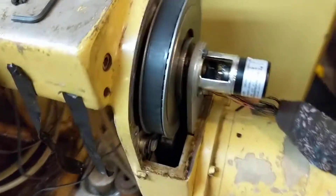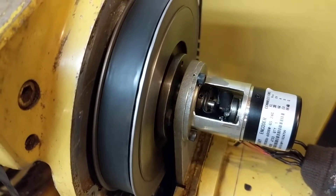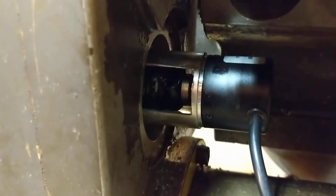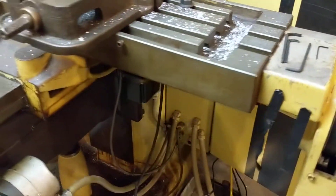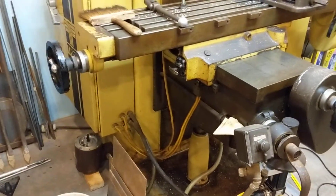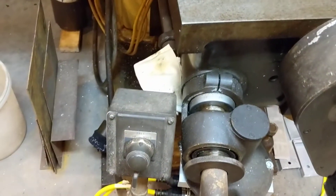The other good news: my encoders are in and they're working. They are full of glue at the moment because the coupler — that little figure-eight thing in there — those were absolutely broken in half. That's why I had so much error when I was doing some machining of parts last month. I couldn't figure out why my holes were eccentric instead of round.